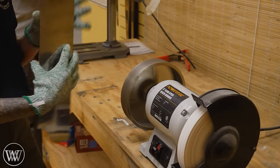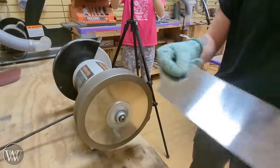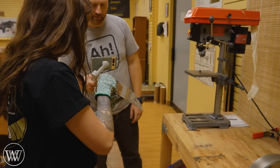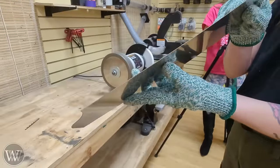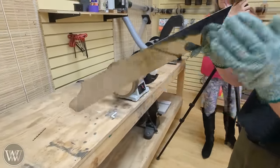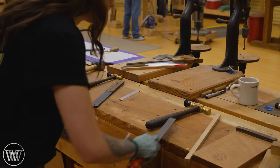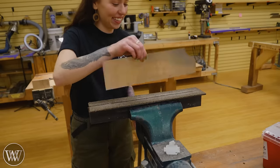All of the rest of the saw still has a lot of burrs left on it from the laser cutting. They have to come over to a diamond wheel and clean off all of the burrs for the OG toe, and some of the other spots they'll do with a file. It's important to do that so when it goes into the back, it's not actually peeling off metal inside the back — it will slide in without a sharp corner, because once it comes from the laser etcher there's a sharp corner that would cut into the brass.